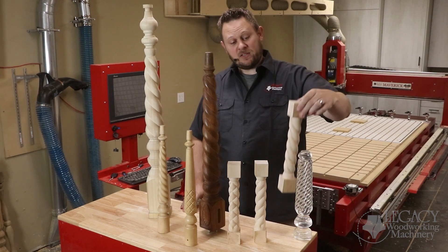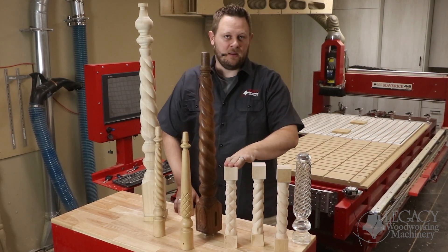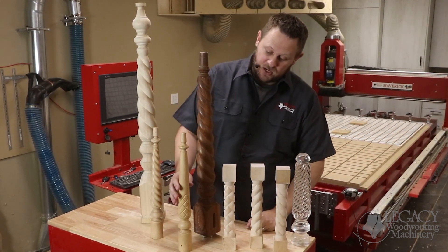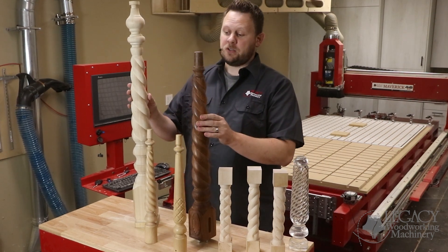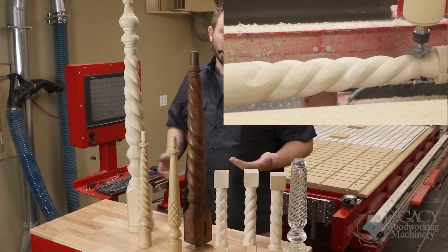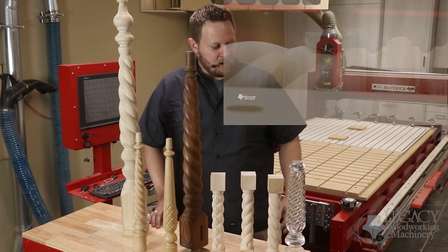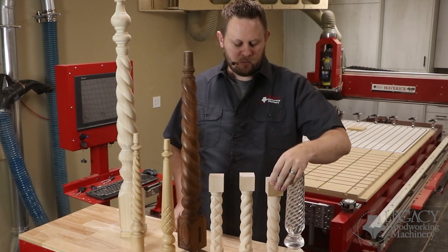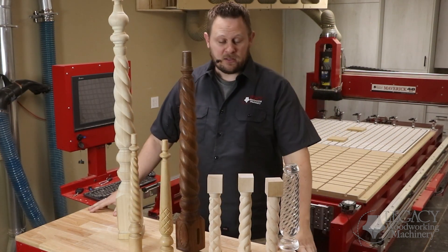Once you've learned how to combine the rope molding cutter with Legacy's conversational CAM software, you have unlimited possibilities. We started with a three-start left twist rope, turned that into a right twist, and also combined them to create the pillow diamond effect. If we wanted to, we could switch out the cutter to a V cutter and create a chisel diamond effect instead. We can also apply that rope molding cutter to tapered surfaces like these using our adjustment axis in the turning center. Without that axis, these would have to be carved. We can also apply different starts — we started with a three-start rope twist, and this is a 15-start rope twist. Once you understand the possibilities, we can control them using our software.